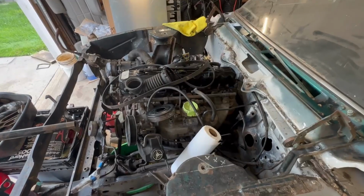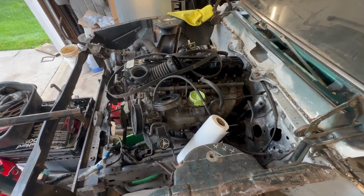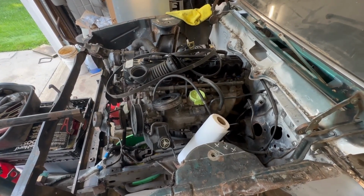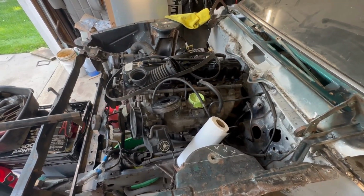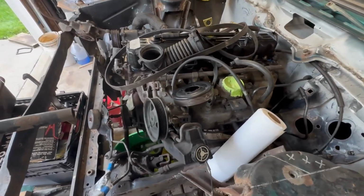See you guys later. Well, we got the water pump off. I'm going to grab a bolt tomorrow at the junkyard. That'll allow me to get the water pump on this next week. Valve cover gaskets on, grounds are on, PCV valves on. Everything is cleaned up. It's probably going to be real hard to tell, but there was an absolute ton of crap in here, and 90% of it's gone, which is awesome.